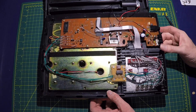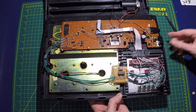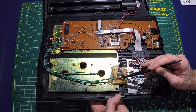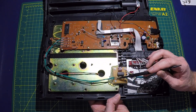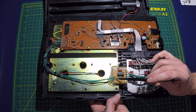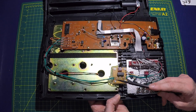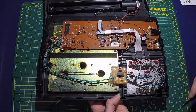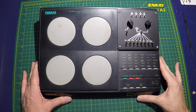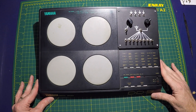This is what my final device has come out to. One thing I added was I found out I had to put 47k resistors on each of the inputs — these are pull-down resistors connecting the inputs down to ground. When those weren't connected, the pads stopped working once I was inputting the gate. And that's pretty much it — that is my circuit bent Yamaha DD5 drum machine. Thank you for watching.